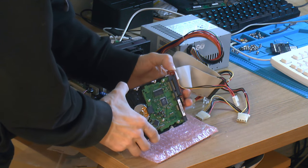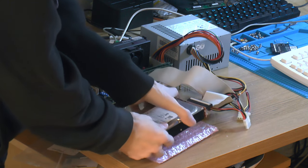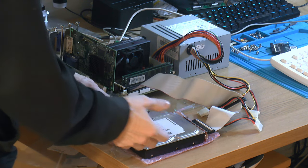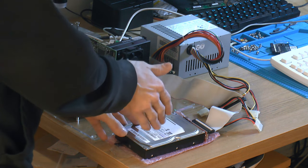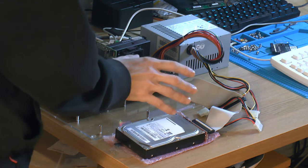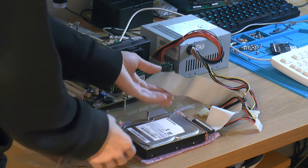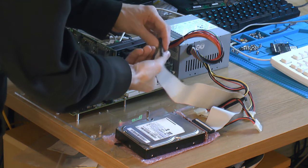I tested one of these hard drives before with the old BIOS, and I think it was detected, but as an 8GB. So what happens is if the hard drive is at least over 137GB or something like that, so like a 250, or a 160 even, it will see it as an 8GB hard drive. And some hard drives, like my 80GB Seagate, just refused to work unless it was jumped to 32GB. So I used one of my lab cables that fits with the key.